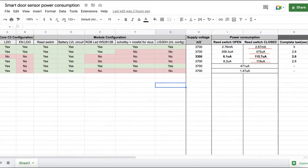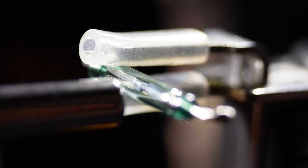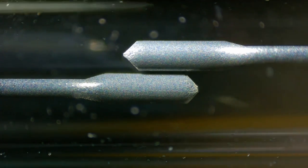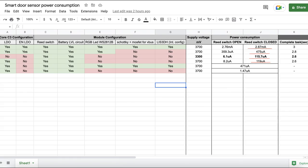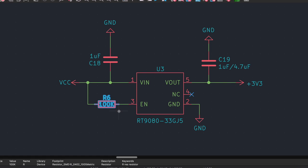Also, when the reed switch is closed, the power consumption is very high compared to when it's open. I will solve this problem in the next video. I found a solution, but I have to redesign the PCB. As you can see, the microcontroller always draws 5 microampere. Perhaps for this type of application, it might be of interest to find an alternative to deep sleep mode. As you can see from the data, I tried disabling the enable of the LDO, which provides 3.3V to all the circuit except the RGB LED. It might be interesting in the next version of the project to take advantage of the LDO enable pin to trigger the system.